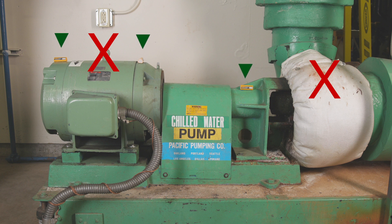Do mount one sensor per bearing in most cases. Remember, vibration transmits 30 to 36 inches. On small machines, one sensor on the motor drive end would see vibration from the other bearings as well as the pump impeller or fan blades. Don't forget to use an additional sensor for bearings that are farther apart.